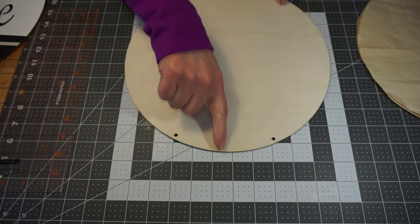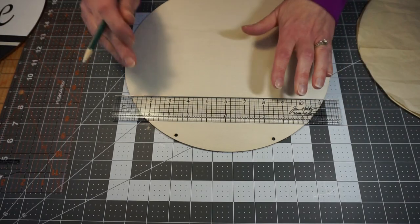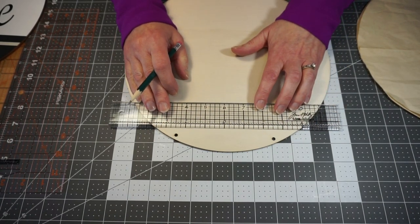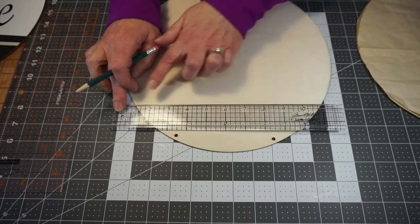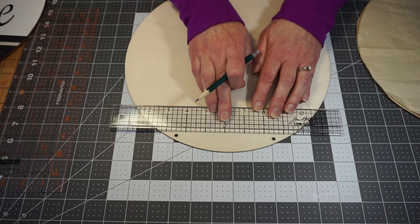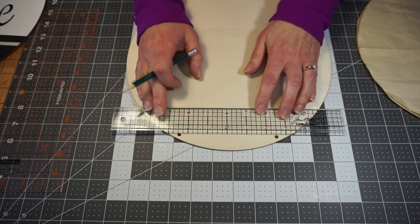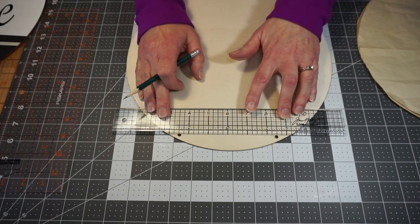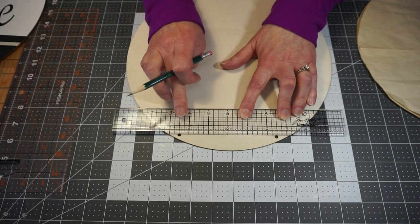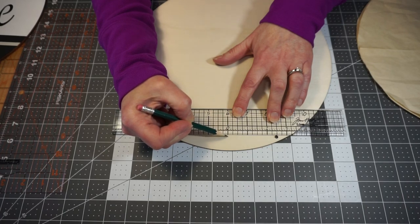So I needed to find my center this direction first. What I did is I took a ruler — this is what they call a centering ruler. It's got 1 to 12 inches on one side, but on the other side it shows you where the half point is, so it would be like the 6-inch mark on your ruler, and then it works out from either side. That makes it really easy for me to find the center point between these two marks. I've got this centered and it's 2 and a half inches out from the center on each side. So I'm just going to make a pencil mark there.